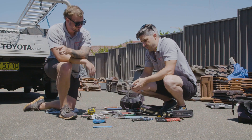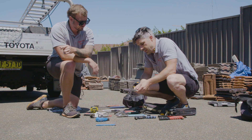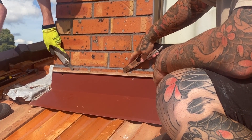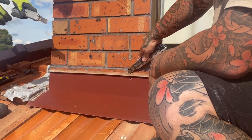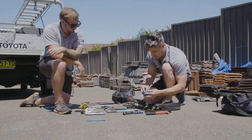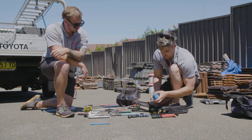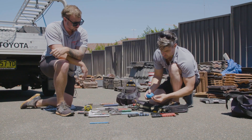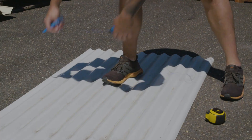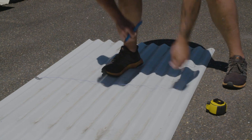You need a big fat knife for roofing because you need to cut your wool, which is very thick, and also you're going to be cleaning silicone from under a flashing a lot of the time. The chalk line is mainly used to screw in off your roof, but if you're doing flashing work where you want a tapering edge — say tapering down from 200 to 80 — you put this on and ping it.